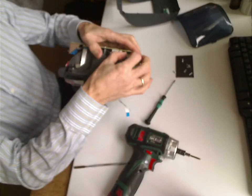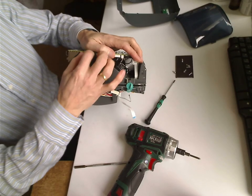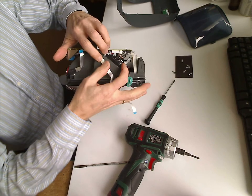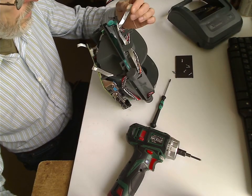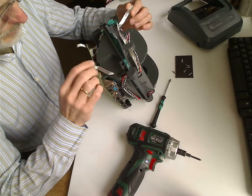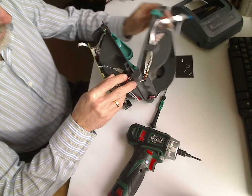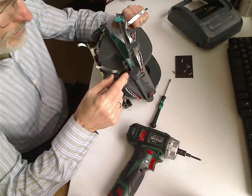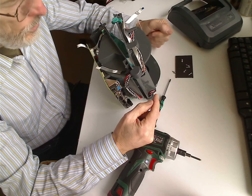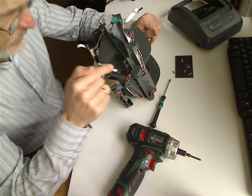So the sensor comes out, and here is the cable from the feed button. I tried to scan all threads with a multimeter, and in this case I got all threads working, but the problem is that here, depending on how the door is closed or open, there is a small tiny break, and sometimes it has contact, sometimes not. So sometimes it was calibrating, sometimes not. Even so, it's a good idea to check, but I will change this cable now and we will see the results. Most likely it is still this cable.